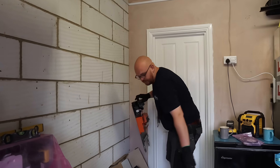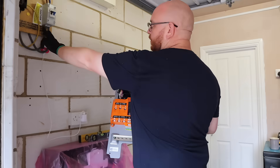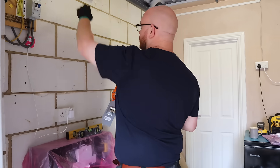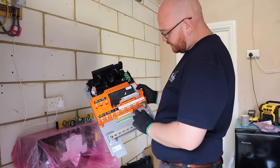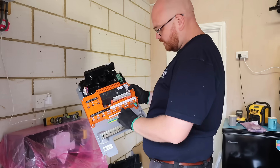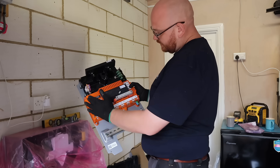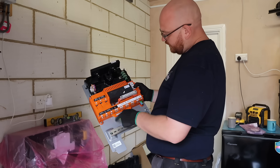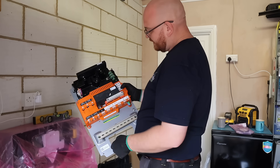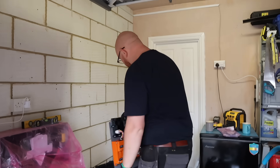With the Tesla we don't have to split off essential supplies at all. Your supply goes into here which comes directly from the bottom of the main switch, and you come out of there which then goes to your consumer unit. We also tap off this and create our own little circuit — a main switch inside actually going to power the Powerwall. In the event of a power cut, the grid section gets cut off so we can carry on using power from the battery. This contactor stops any flow of power going back down to the grid, and we keep the house running in the event of a power cut.